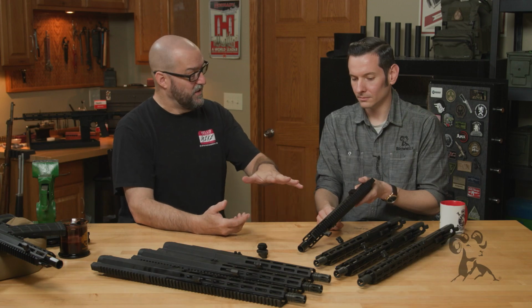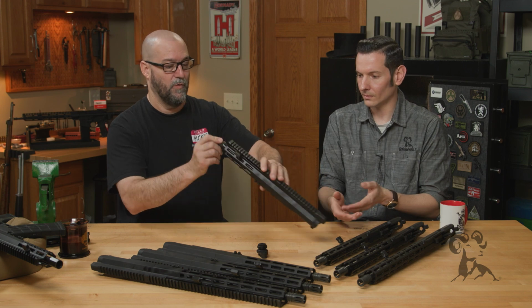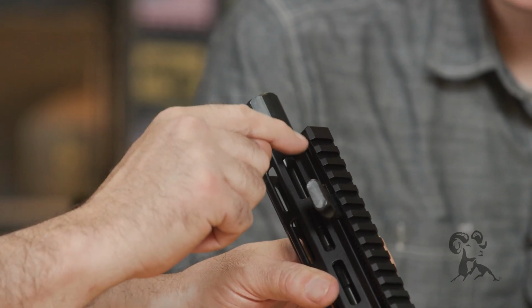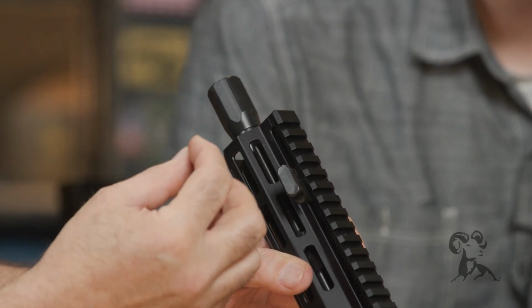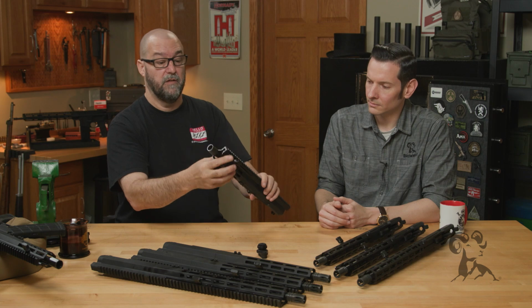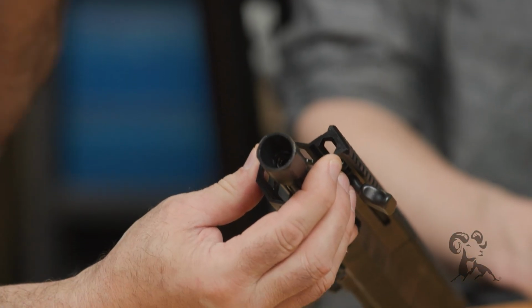One of the cool things I forgot to show you is that we saw in the previous video how the trolley was a round piece of steel. And we engineered a shape here that's a hex. You see that? So that a round shape is living in a hex shape so that it's being supported on a very small bearing surface. That was an idea of a young engineer named Neil Trout. He did a very good job of supporting us with this. Neil's a very talented guy. We used to work together at Wilson Combat.